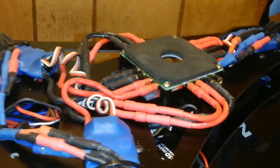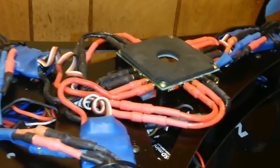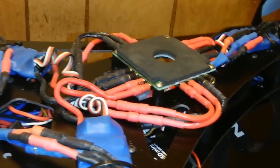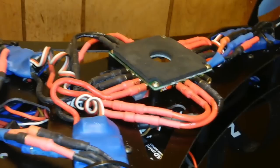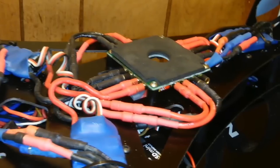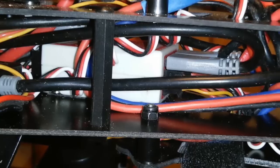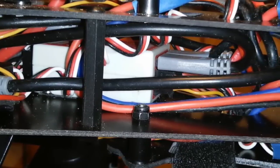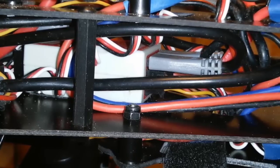For the remaining two slots I made a custom switch-style cable: one side has 3.5mm male positive and negative connectors, and the other side has JST connectors. I use these to power the Naza and to power the video transmitter. Now let's go to the flight controller.